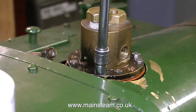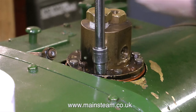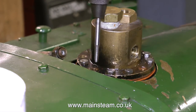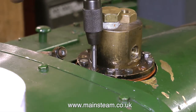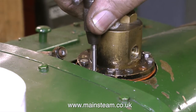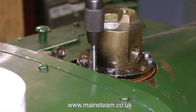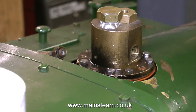I'm putting it all back together. These are M4 stainless steel bolts. You can see that the bolt to the left of the socket is very rusty — this is one of the original bolts that were very difficult to remove, because the bolt holes go all the way through the bush into the boiler. So it's no good putting steel bolts in there; that's why I'm replacing them with stainless steel bolts. I'm also using an M4 tap just to clean up the thread, because when I put a stainless steel bolt in it felt very rough and a bit too tight.